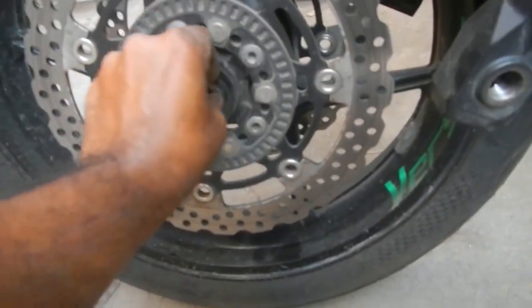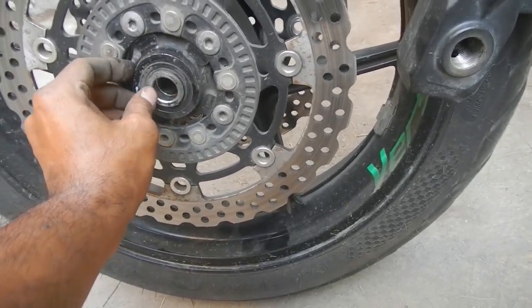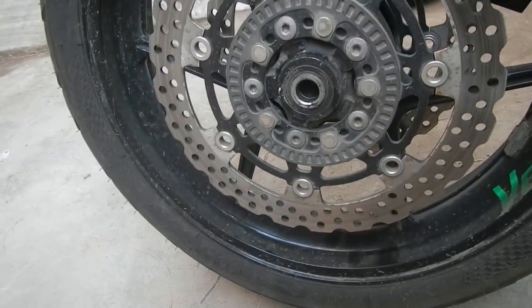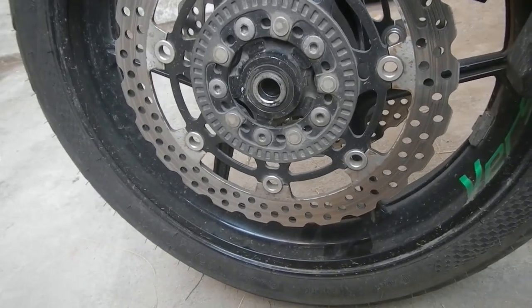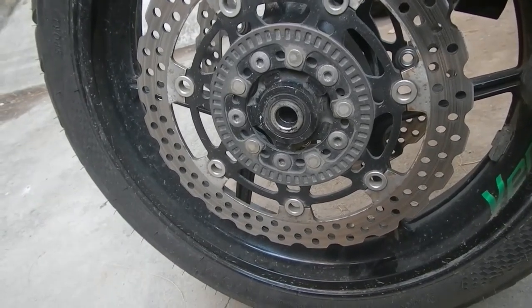The bushes need to be taken out carefully — make sure you don't forget to put them back. There will be a rod inside which keeps the shaft centered. That has to be taken out carefully as well. I'm going to take out one bearing at a time.